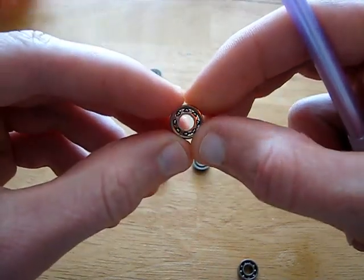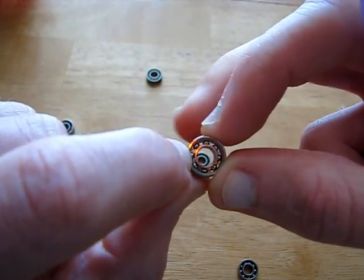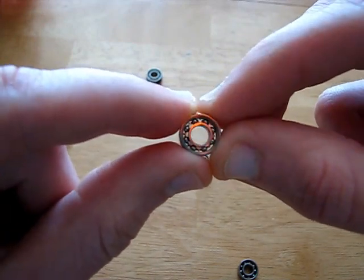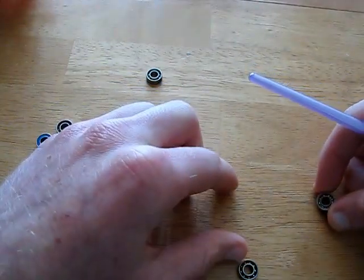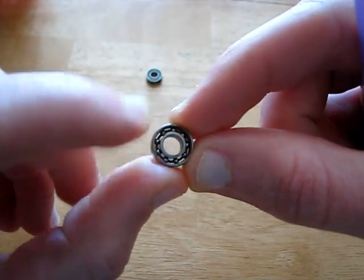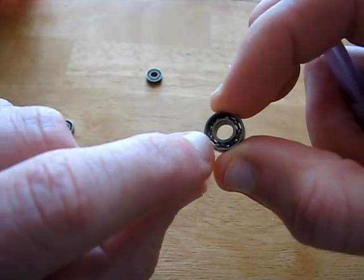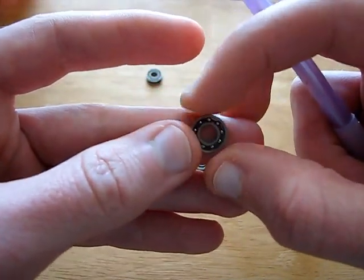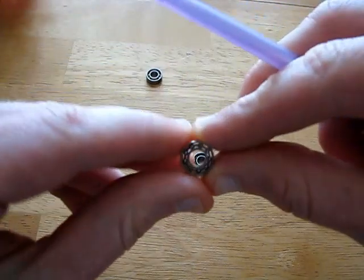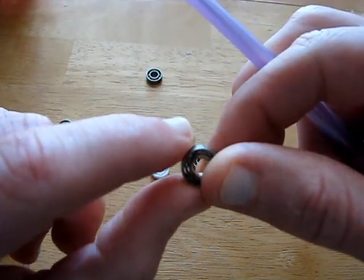This is getting a little picky, but going into rubber shielded bearings — certain kinds have cages that are double-sided. I don't know if you can see that or not, but on this side the cage looks the exact same as these ones. I found that oil and grease is a lot harder to get out of the double-sided ones than ones that are just single-sided. You can kind of see the whole bearing on one side, and then the cage a lot more on the other. This single-sided cage is a lot easier to get grease and oil out of. From testing maybe eight different types of bearings and seeing the run times, I found these single-sided cages to work much better in getting the grease out.